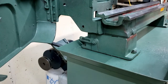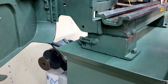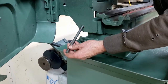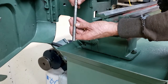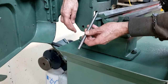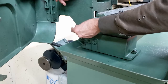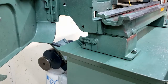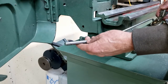Here, we're going to start with the motor. It's in a bad spot to film, but essentially this is the shaft that goes through here and supports the motor mount. Now, it's a set screw that goes down into here that wasn't tightened previously, and the shaft that protruded out through here wasn't being held on the other end. So, do that a little better. Put a little oil on here. Can't hurt.